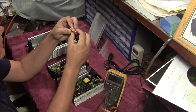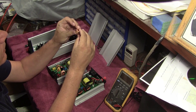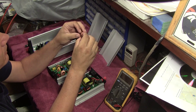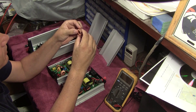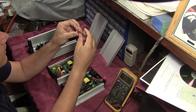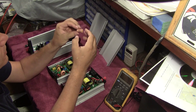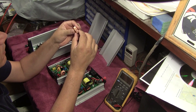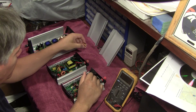The one that was rattling around had this inductor broken off. I see a pretty good ding there — I'll look at this under the microscope and see if it can be repaired. If I unwind a winding or two it's not going to change much, but I'll see if anything else got dinged. It's bare copper that's been varnished — pretty hard, but not impervious to rattling around.